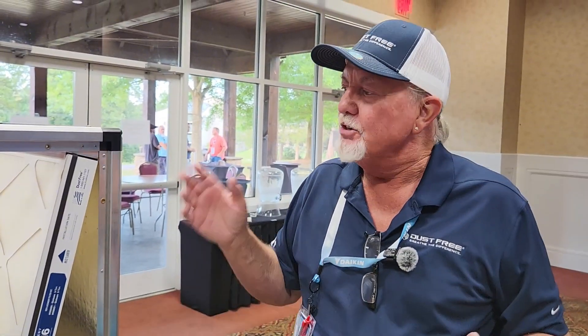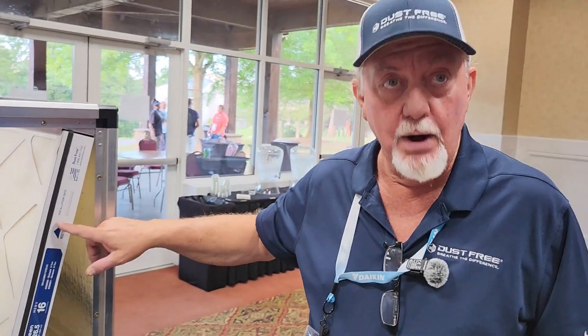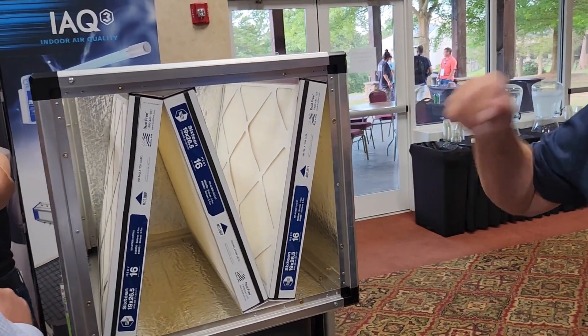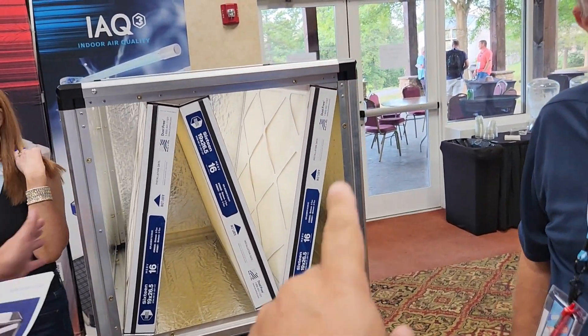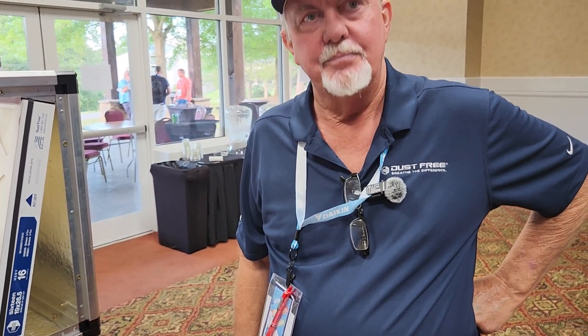That was important for us. If we're going to go to market, we wanted to be the best in class. People always ask about filter life. Right now, our published data says under decent conditions — and hear me: if you live on a farm, you've got eight dogs, three cats, ten goats, and eighteen chickens, and the doors are open and Grandpa's plowing the field, you will not get three years out of this filter. We're rating this at a three-year usage. That makes sense because you're taking 70 feet times three — so you've got 210 linear feet to spread that three years' worth of dust. It's all about the surface area.